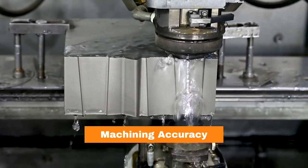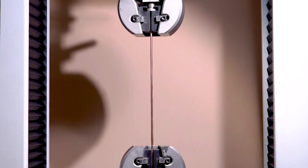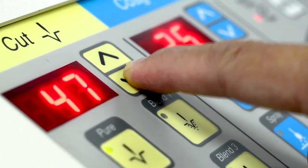But all this leads to exceptional dimensional accuracy and surface finish. To achieve the highest degree of machining accuracy using a wire EDM, a number of variables come into play — including the correct wire material, its tension and diameter, the correct power setting, and the condition of your deionized water and its flushing arrangement. However, expert machinists working in challenging applications like medical or aerospace sectors consider many other factors beyond these and try to control them.